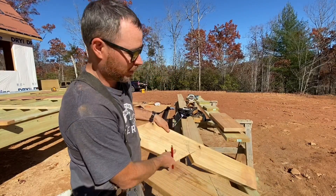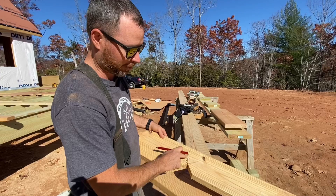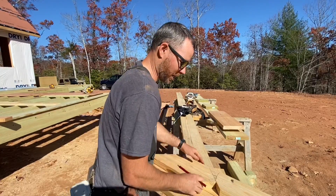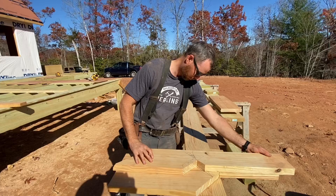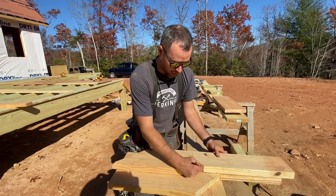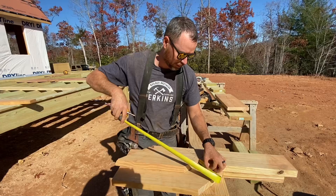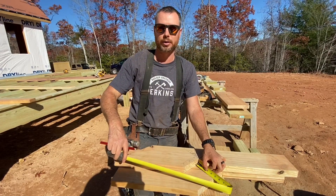All I'm going to do is take these two mock-ups, flush the top of these, and line up the plumb lines representing the outside of the wall and the outside of the beam. Then we're going to measure and see what the wall height difference is going to be. Got them flush on top and I've got the plumb line lined up right there. My new beam needs to be four and three-quarter inches taller than my existing wall. So that's what we're going to do.